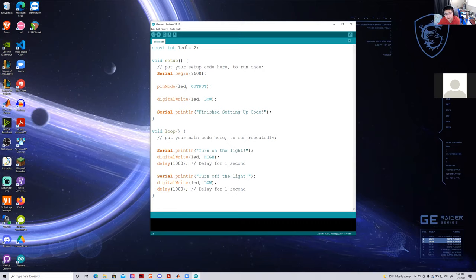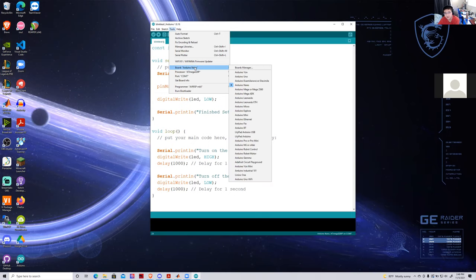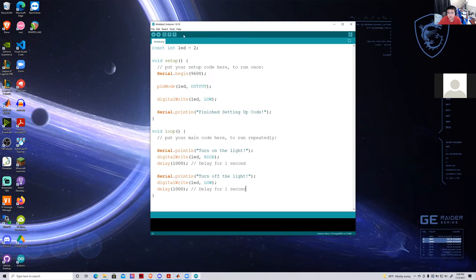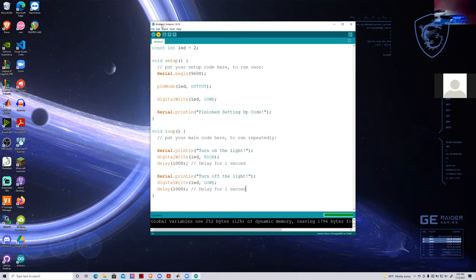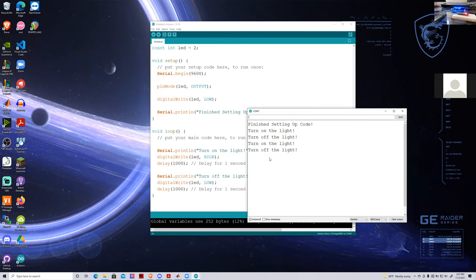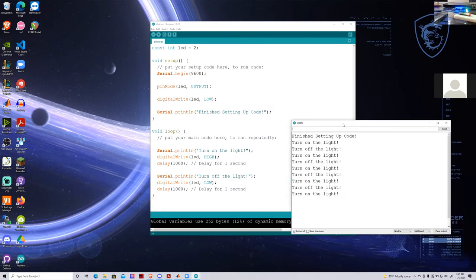Let's upload our code. When we upload to the Arduino, take a look at Tools first — it says board is Arduino Nano, processor is ATmega328P, and port is COM7. This port is really important because your computer knows to access the Arduino through it. If everything is good, we upload. You can see the green light blinking on and off, which is what I said it would do. Looking at the serial monitor, we can see 'turn on the light, turn off the light' repeating. This data is coming from the Arduino itself, sent through its USB port to the computer. These are our fail-safe statements — if something fails and we don't know what's going on, we can put a print statement there to make sure the code reaches it.